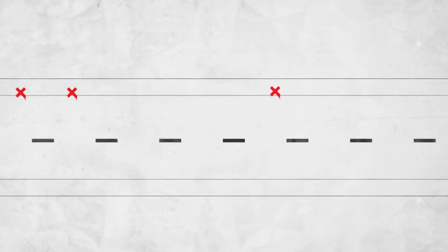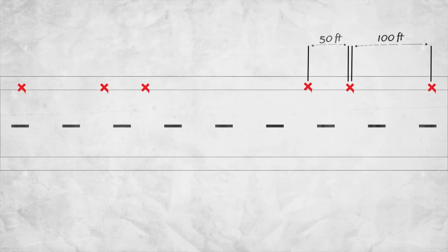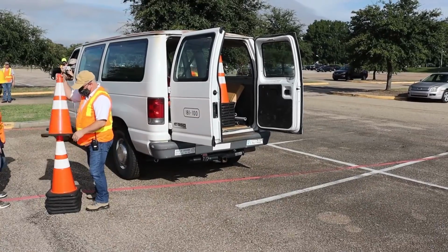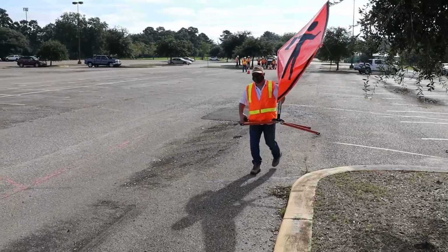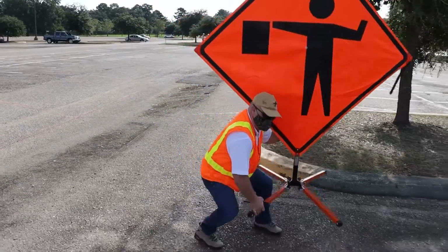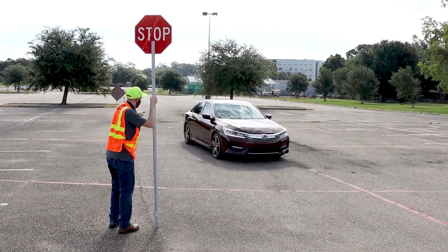Moving past the activity area, go ahead and measure the transition area for the closed lane, and then the warning sign distance, in this case, 50 and 100 feet respectively. Recheck the warning distance by moving up to the beginning of the transition area. Post the flagger and unload the rest of the cones if necessary. If the distances are short, again, you may measure by walking down the shoulder against traffic to place the sign, but it is always a good idea to cross the road on the way back so you will always be facing traffic. Before any work vehicle enters the roadway, flaggers begin flagging traffic.